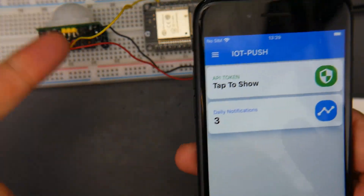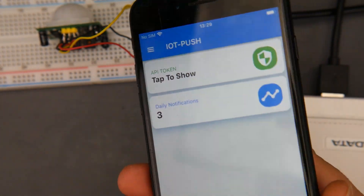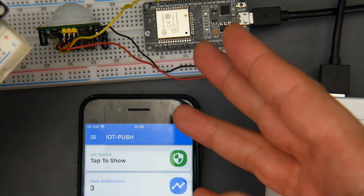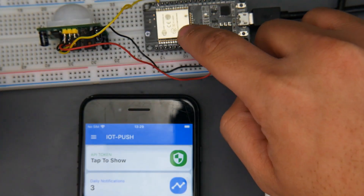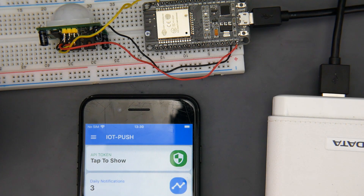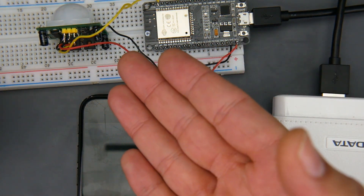However, you don't have to use the Android or iOS application, but if you want push notifications then obviously you're going to have to use a phone. You could also just use it with the web panel if you wanted to. Before we jump in, everything here is going to be linked below. We have an ESP8266 and ESP32s, and I've done the code for both — you can find it on GitHub in the link below. We're going to go through the documentation and also show you how to flash and set this up, whether it's a temperature sensor or even a motion sensor just like this.